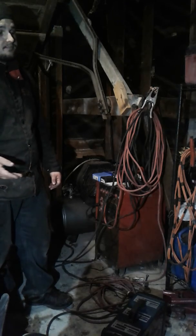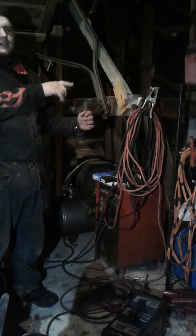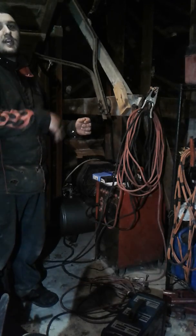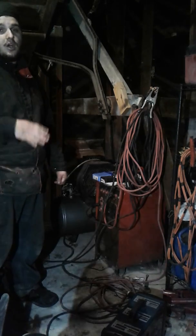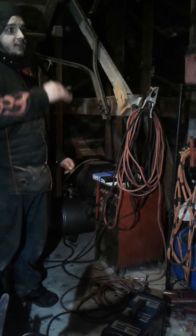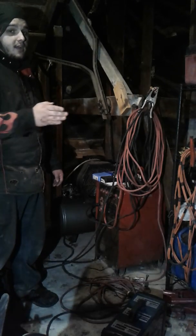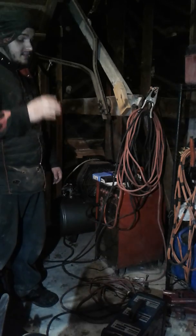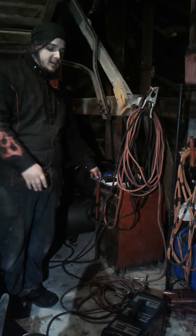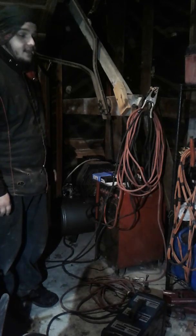If you look at the old buzz boxes on the Home Depot website, you'll see something like 75 amps with a circle around it — that means 100% duty cycle. Anything at that amperage and under is 100% duty cycle on those machines. On the inverter, the lower you go in amperage, the higher the duty cycle gets — so at lower amps it's way more than the rated 60%. That said, it's a different kind of machine and there's simply not a huge copper core inside.